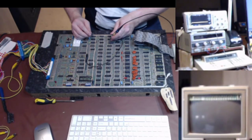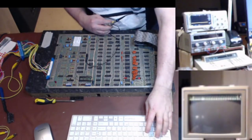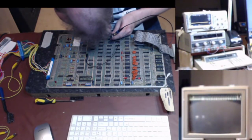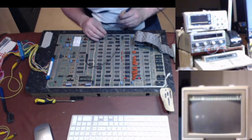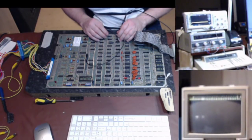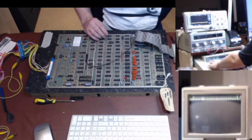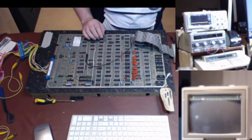3. So what's it showing on there? 3 in, 4 out. That would seem about right. 3 low. There's your 11. Yep. Now I should have a clean bus. I do have a clean bus. It's the chip at C6 that's my problem.